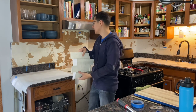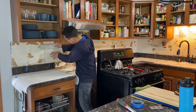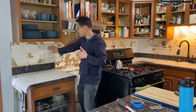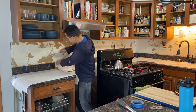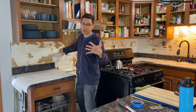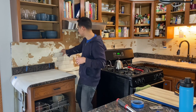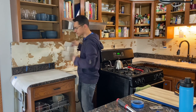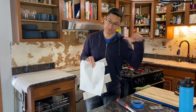If I've got to go through and cut the tile where I'm working with maybe an inch or so on both ends, so be it. What I don't want is to cut a half-inch or quarter-inch piece just to fill that little spot. Let me show you — if I lay this here, this looks nice; I can land the strip right there. But I want to do a dry fit — measure twice, cut once. Check the backsplash at least twice, get your partner's opinion, and then go. You don't want it to look like an amateur did it.